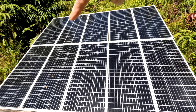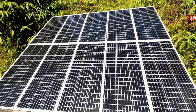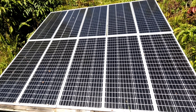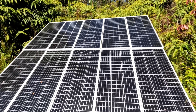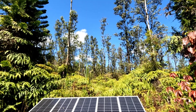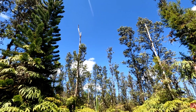Here's a quick look at the strings — that top string tied into the Victron is letting in as much power as it possibly can. The panels are very hot with the sun straight overhead, so it's not hitting the full 500 watts, but it's doing fine at 400-and-some watts. This lower string tied into the EPever is in full sunshine and should be doing the same thing, but it just doesn't. I've quickly become a Victron guy, that's for sure. It's a gorgeous day, about 84 degrees but feels like 88 — catch you guys on the next one, aloha.